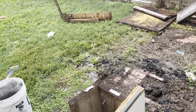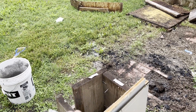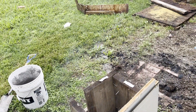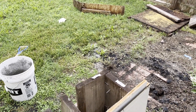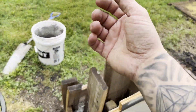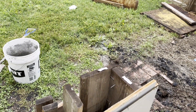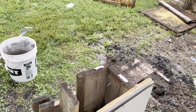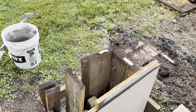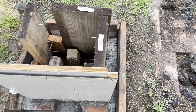The reason I'm taking that old oven apart is that when I built it, I made the interior volume too small for some of the projects I want to take on now. Also, a while back the heating coil burned up in it. The opening was only like a four-by-four inch square — you could barely fit an arm in — but it was 18 inches deep, and the door folded down from the front. Once the coil burned up, changing it would've meant cutting the top off, so I'm just repurposing it.